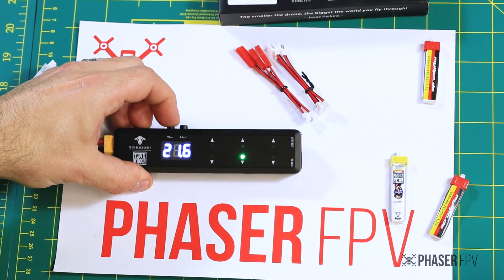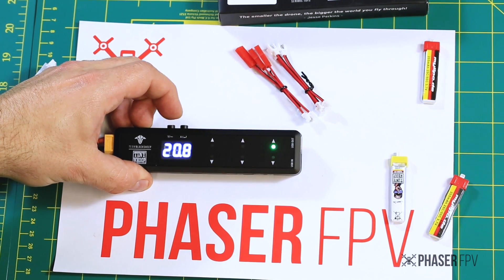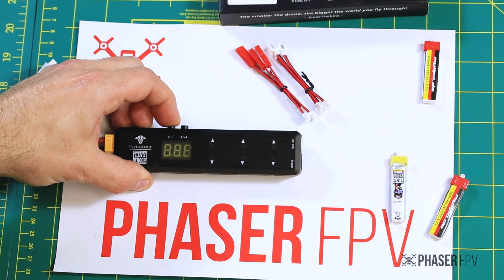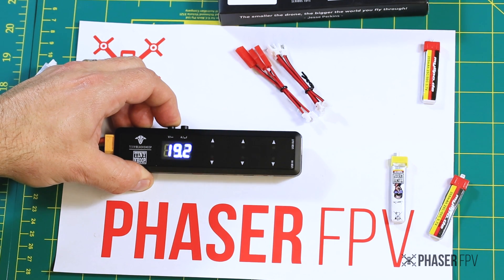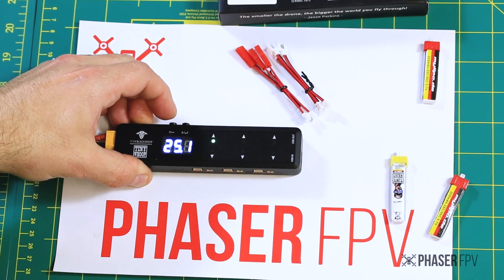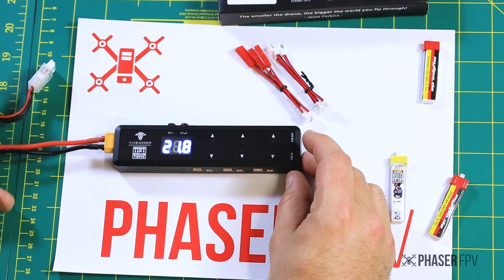One of the other things you can change is your low voltage cutoff. If you want to cut off your LiPo's input at, say, 3.5 volts per cell, you can do the calculations to figure out exactly where you want it to drop. You can see this one has recognised it's a 6-cell battery and it will drop down to around the 18 volt mark. Set that before you start charging to make sure you don't damage your input battery.